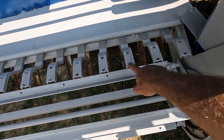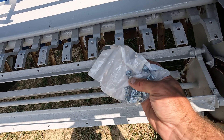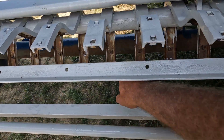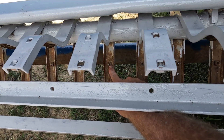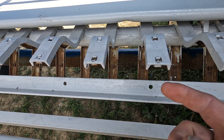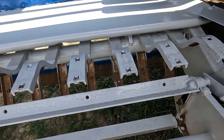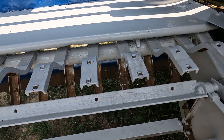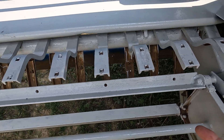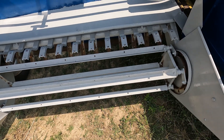These are the parts — this is the hook portion of the panel nut. They've got little hooks, and here's the back side of the panel nut. It's designed for slight misalignments — the nut can move around inside the pocket. I had quite a few missing so I ordered a pack of 25. We're going to get those put in so we can get the tines back onto the roller cage and then put the hoops on.